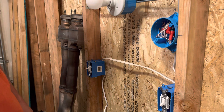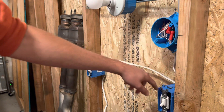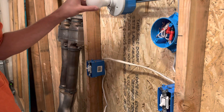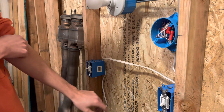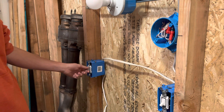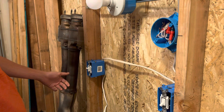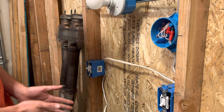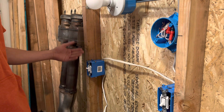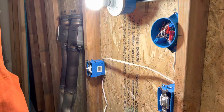I can explain that scenario in another video, but for now I just tied this light through right here — just tied these wires together. I didn't put a second light in yet because I didn't want to deal with that out. But anyways, it's pretty sweet — got everything working. So that's how three-way switch works: you can turn it on from one location, turn it off from another location, and turn it back on from the first location.